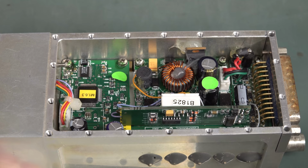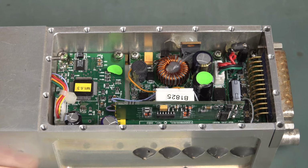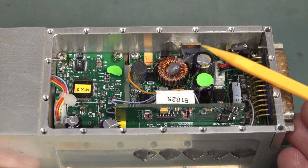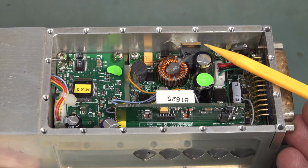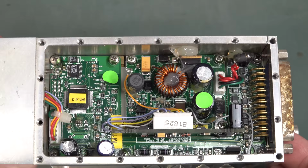on a trolley, even with a trolley with big pneumatic tires on it, the vibration of that, every day for three shifts a day, for 6 months or a year or something, was enough to vibrate the TO220 loose and it just snapped off. It was the fatigue on the legs of this thing, the vibration hit the right resonant mode or something, and it eventually just fell off. So that happens. So anyway, nothing interesting there.